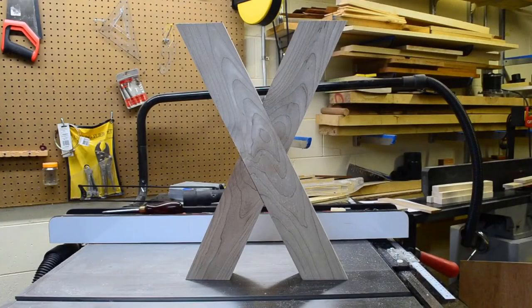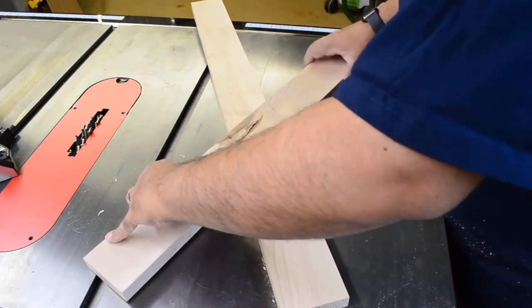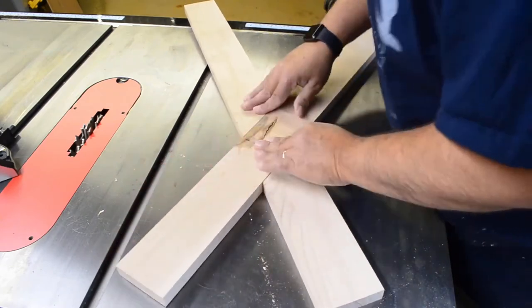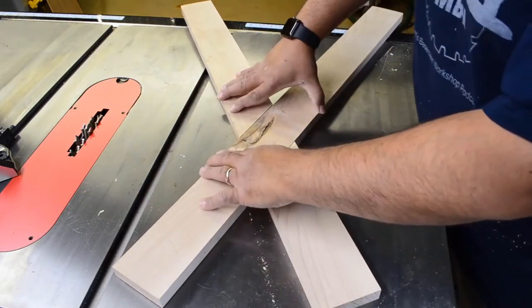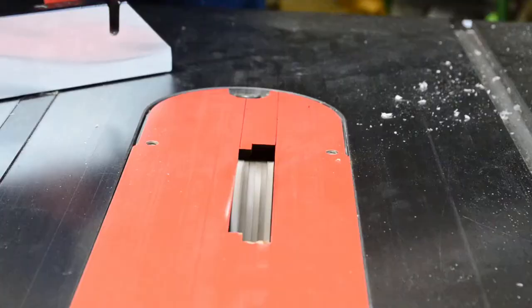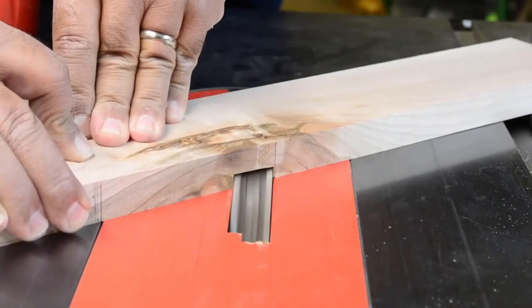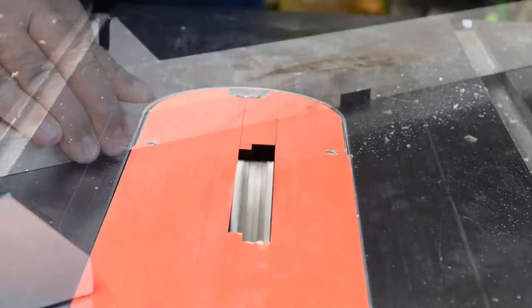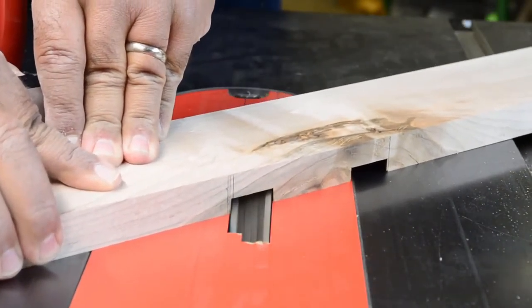The next component to build for the shoe bench are these cross legs, and to do this, I opted for one of my least favorite joinery techniques — the half lap. Half lap joinery is already complicated enough, but adding an angle to it is just asking for trouble. In hindsight, there are far more accurate ways to achieve repeatable results for this joinery, but for this project, we set our miter gauge to the correct angle, draw reference lines in the throat plate to define the outer cutting edges of the stacked dado, and because my preferred method with any half lap is to first cut both shoulders to establish the width, I start by matching the layout lines in the leg stock with the reference lines in the throat plate.